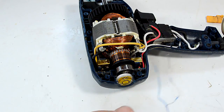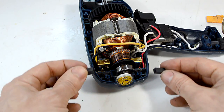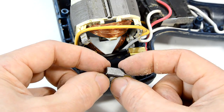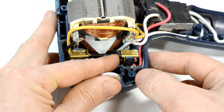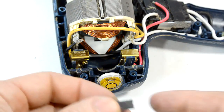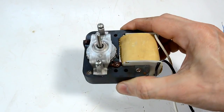In a drill, we don't just use a couple of pieces of copper wire to connect to the commutator - we actually use something called brushes. We call these brushes even though they're actually just little pieces of graphite, and they go into holders here and here. These carbon brushes will slide much better and wear much slower than a copper wire would. But even these brushes wear out, so the brushes are always inside of a spring-backed holder. As the brush wears out, it can continue to move forward. Eventually there'd be no brush left, and then the motor needs to be serviced and the brush replaced. That's why we never use a motor like that in applications that have to run for a very long time, such as a fridge, an air conditioner, or a furnace.